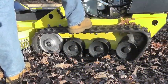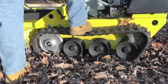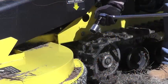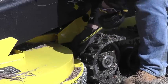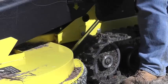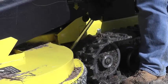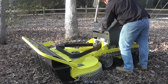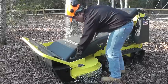Lastly, check the tension of the tracks by placing your foot on the center of the track and making sure there is no more than one inch of deflection. This will ensure that the tracks provide the best performance and reduce the possibility of slipping a track. If the track is loose, use your track tensioning tool to turn the tensioning bolt until the tracks return to proper tension. Finally, replace the deck and engine covers and secure with the quick-release fasteners.